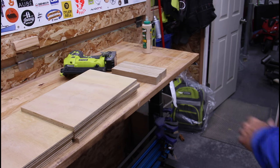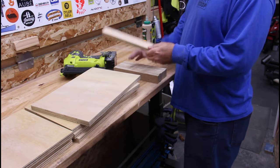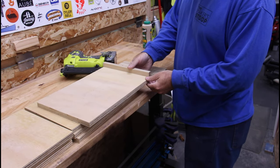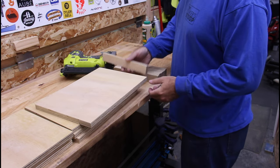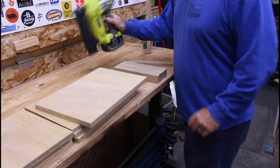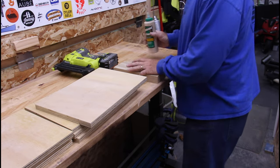The next step is to build the shelves. Here's a shelf bottom and here's a shelf front — it just goes right on the front like this and provides a little lip to keep the soda cases from sliding out. I'm going to use 18-gauge brad nails and a little bit of glue, and that should be it.